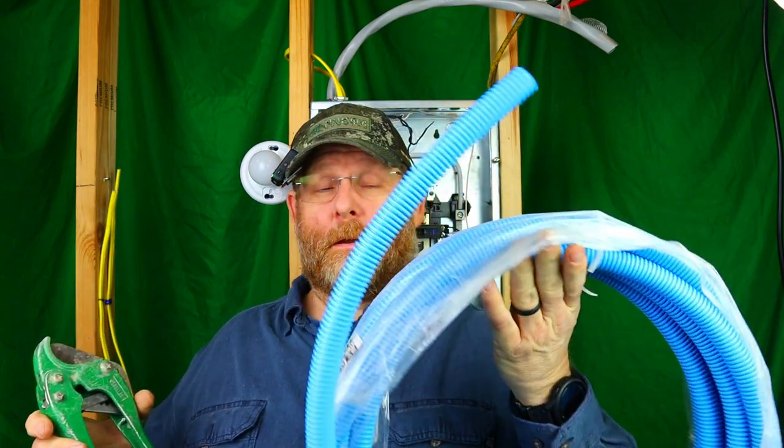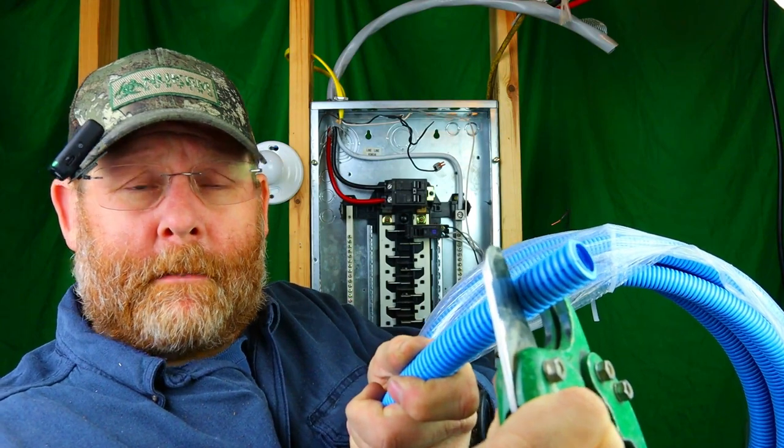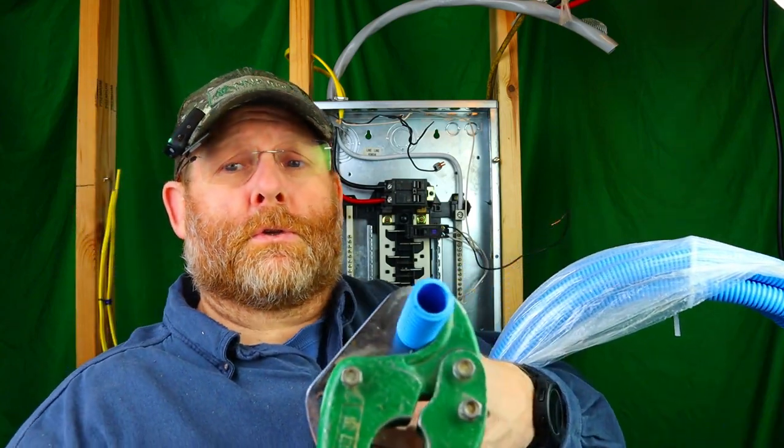There are several ways to cut this. These are PVC cutters — with smurf tube it's super easy to cut, so you don't need a super industrial pair. These are the Greenlee brand. I'll leave a link below to the Greenlees and also to a cheaper brand. Both work because this stuff, even though it's considered tough, is still easy to cut through. You can also use a knife, hacksaw, bandsaw, or port-a-band. To cut, just open your cutters, put it right in the groove, and it cuts super easy.